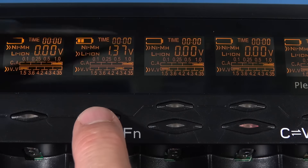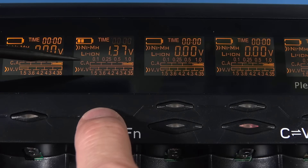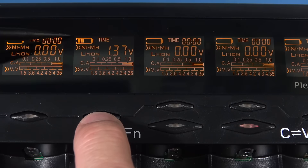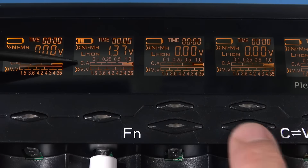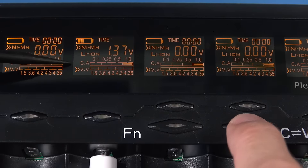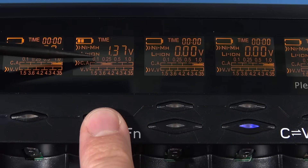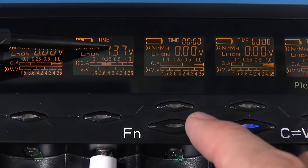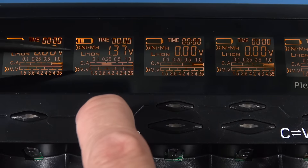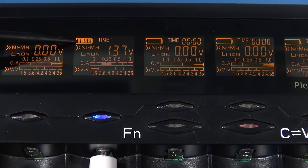You're at no risk of the charger automatically starting - you have to start it manually, which I prefer. Using the C-V setting, current is shown in blue and voltage in red. You rely on the double-arrow indicators to show what you're currently setting. Once you've set the voltage you push the button and step through the voltage levels, then go and select the current - for instance, only charging at 250 milliamps.